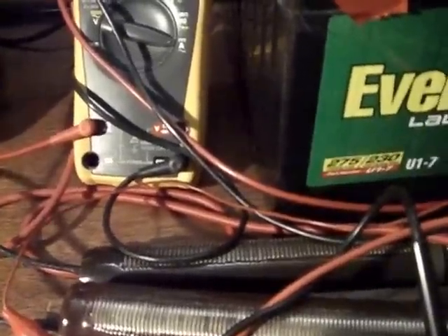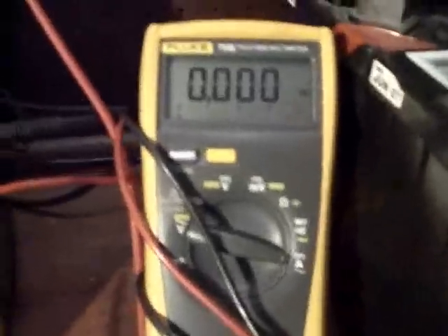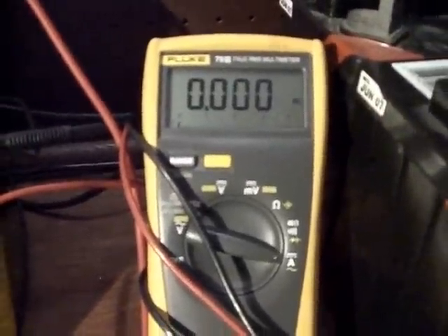It's going to show that the battery voltage has climbed over the last 9 hours. All the data indicates the same thing should be happening. This meter is showing a negative zero on the amp meter, and that's hooked in series — positive — and then the negative is going into the wire coming into the load, from the load into the drain of the MOSFET.